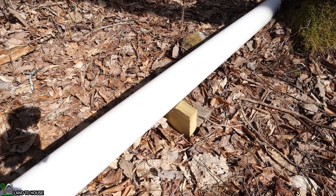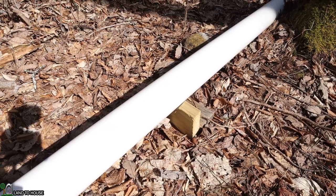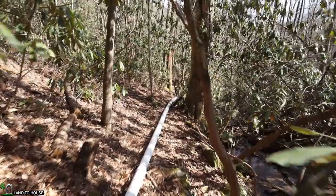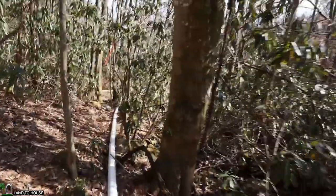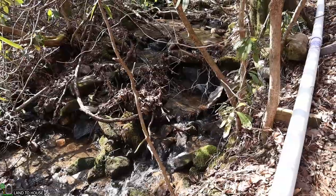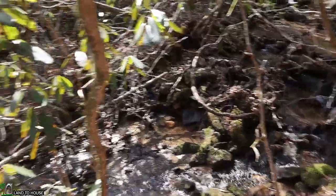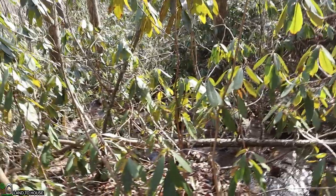For places that would have a dip, you can see a block of wood has been carved out to hold the pipe in position. I'm actually hearing a little bit of air running through the pipe right here — though I doubt that'll pick up on camera. For those concerned the creek looks dry, you can see there is easily another 100 to 200 gallons of water flowing past at this moment that is not going into the turbine system.